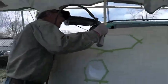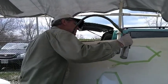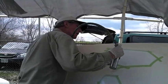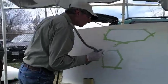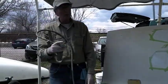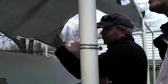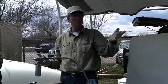Will sanding take off the orange peel too? Yeah — you'd sand it with a foam pad. I'm putting on some extra because I don't know who's going to be sanding this. Start at 320 grit. You can see orange peel in it now, but come back in a couple hours and it'll be gone — that's the magic of Duratec, I'm never without it. On this boat, go from 320 to 400 to 600. I'll leave you three sheets of paper to work with.